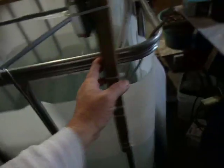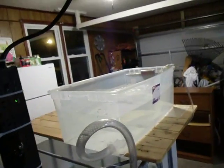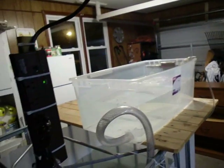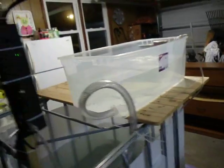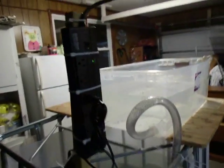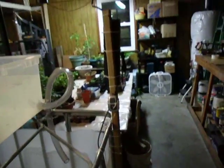I've got this wooden post mounted to this IBC tote and a power strip. The power strip does get plugged into a ground fault circuit interrupter. A GFCI is absolutely necessary when you're playing with electricity and water — it's very easy to get water and electricity combined, which can produce an electric shock. The shock can be painful or even fatal. The GFCI is designed to trip around 4 milliamps of current, so before you feel the tingle it should open up. Got to have one of those.